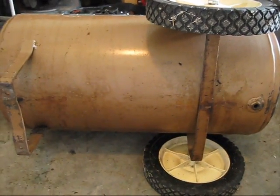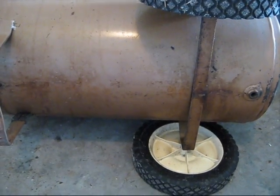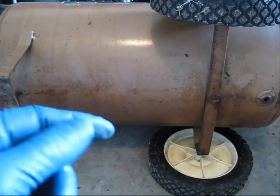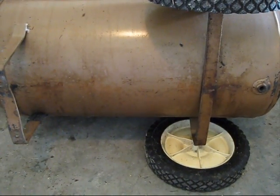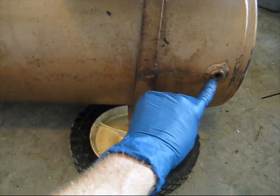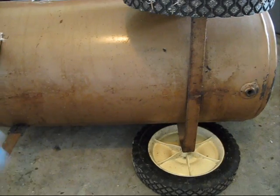I flipped it over on its side and you notice there is a bit of rust buildup on the outside. Now rust buildup on the outside of an air compressor is always a bad sign, because when you're dealing with air compressor tanks they tend to rust out from the inside first. Compressing air will build up condensation and all that condensation ends up in the tank. They always have a fitting on the bottom which is supposed to have a drain valve so you can drain all the moisture out so it doesn't completely rot.